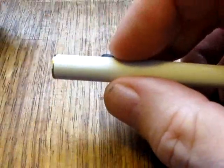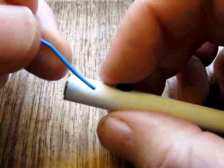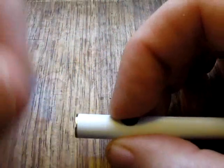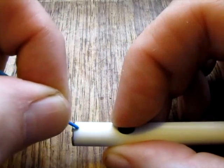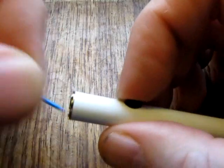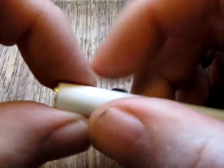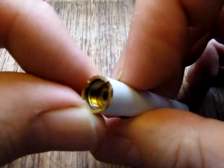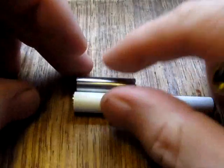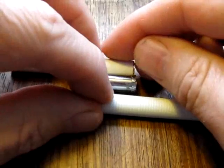This is a good battery, obviously, and again, similarly, I cut it round about there, and then what I did have to do in both cases was hacksaw through the length of the part that I'd cut off, so I could peel away the outer metal casing of the battery housing, so I could just pull out the connector, which is the bit I want. So what you would then end up with is one end of a battery for a Super there, and the other end of a battery from a Titan there,